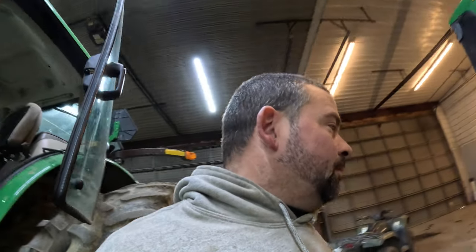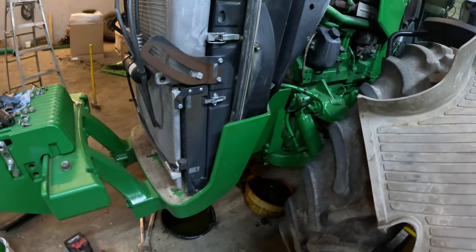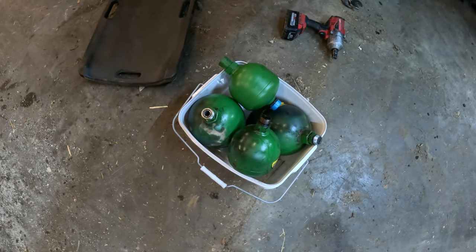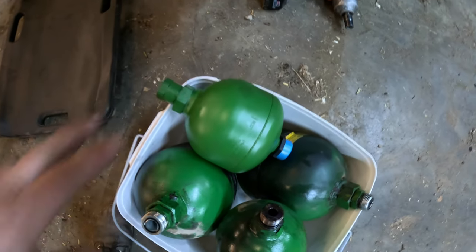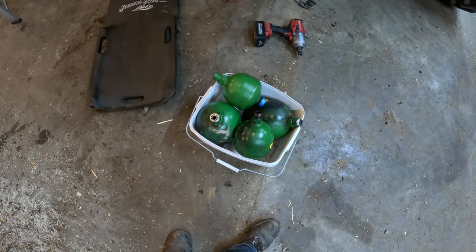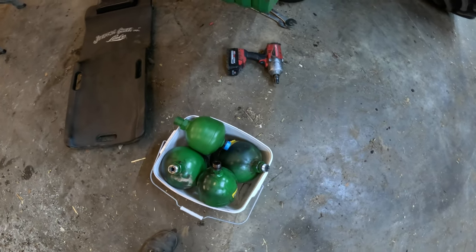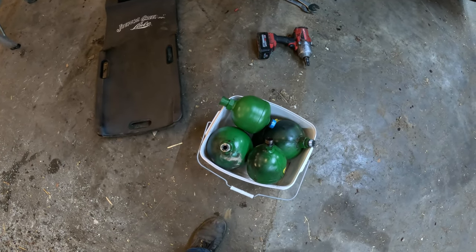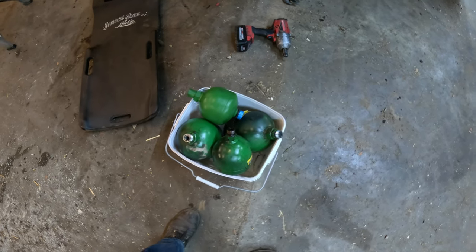Back to share — I know I said last time I didn't share in a while because I really didn't do anything new. Well, got a couple new things going today. Got a couple tractors in the shop. This one is ours — the suspension was rigid on it, so I pulled the accumulators, took them up to our John Deere dealership, Deer Country, and had to get one new one as it didn't take a charge.